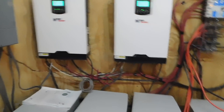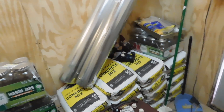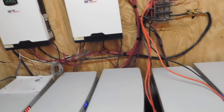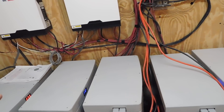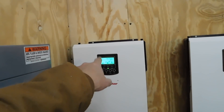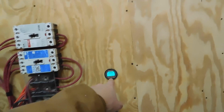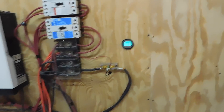Once we built the battery room, I upgraded the batteries. The ones I had before were lead-acid Trojan L16E batteries. These new ones are lithium-ion — they are not cheap, very expensive, but really awesome and very efficient. They charge up very well. Right now at this time of day we have 527 watts coming in on one side and 401 watts on the other. The batteries are reading 27.16 volts and climbing — we're bringing in more power than we're using.